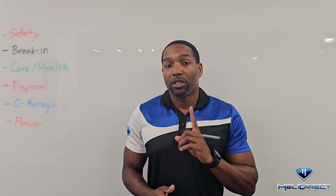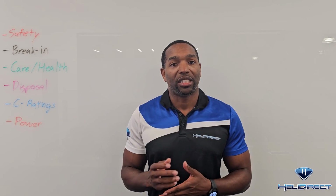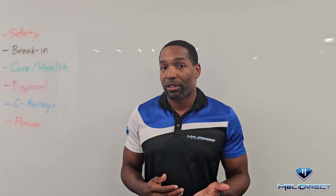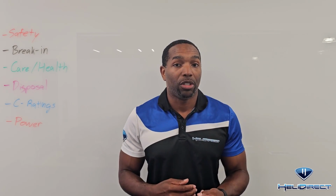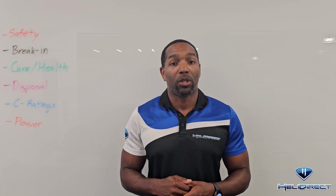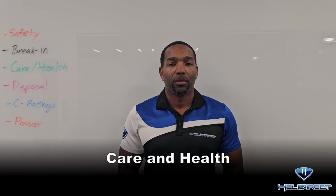With that said, there is one thing to remember though. In my experience, it seems to take about 10 to 20 cycles for a battery to be fully broken in. Now, how many cycles it takes for your battery to be broken in is going to depend on the brand, the method you use, and a host of other factors. But generally speaking, 10 to 20 cycles is about how long it takes for a LiPo battery to reach its maximum performance.